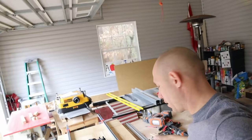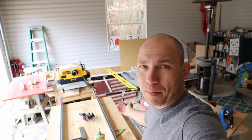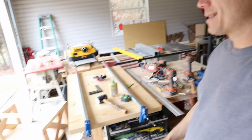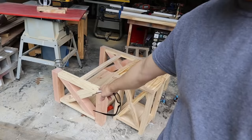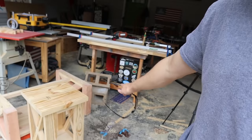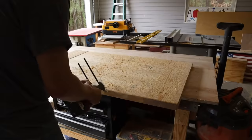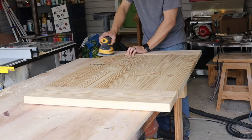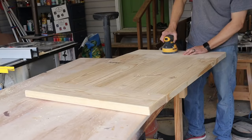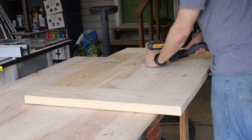For the breadboard ends, the regular tabletop is 35 inches, pocket holed together on the bottom side, and it's 28 inches wide — that's how wide I cut my breadboard ends. Both of them are exactly the same. Once I get this sanded down, I think it's going to look really nice. We're going to go with a dark walnut stain on all this. I'm using my router with a quarter-inch roundover bit — I like to round over all the edges so everything's nice and smooth. Then I take my orbital sander down to 120-grit sandpaper. I start with 120 and don't ever go lower than that, especially for pine.